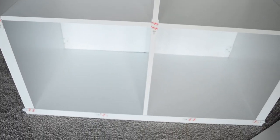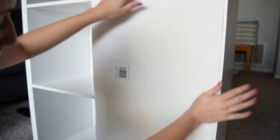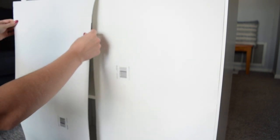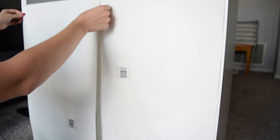After doing a lot of thinking, I decided I didn't want to permanently attach a back onto these cabinets because I may want them to just be a plain cube shelf again. So I used command strips and Dollar Tree poster board to cover the back of the cabinets. If you wanted it to be permanent, I recommend getting a thin piece of plywood or MDF, cut it to size, and then staple or nail it onto the back.